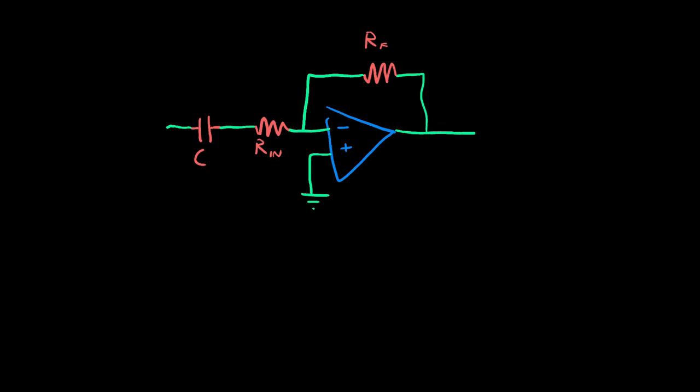Another benefit of this layout is you can easily create a high-pass filter on the input just by adding a single capacitor. This is key to how we will recenter the Werkstatt's VCO around zero to make it easier to mix with other Eurorack audio signals.